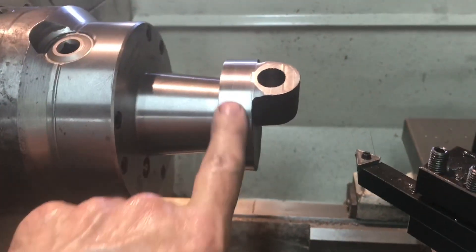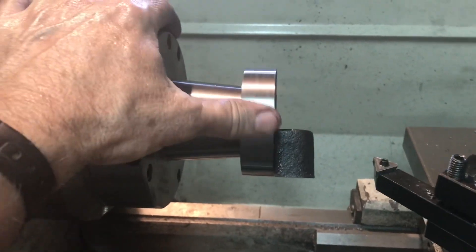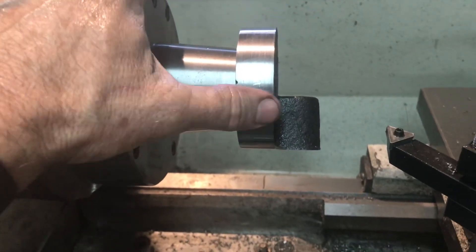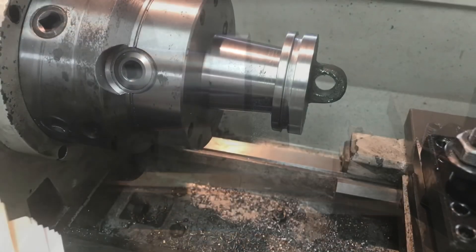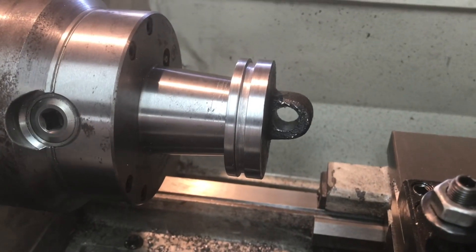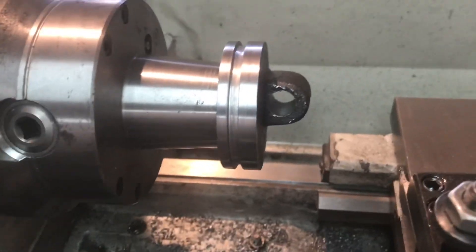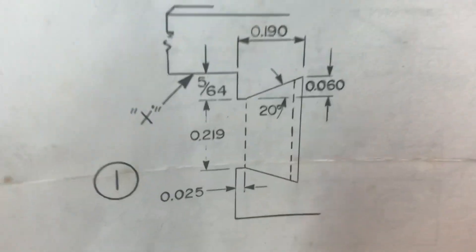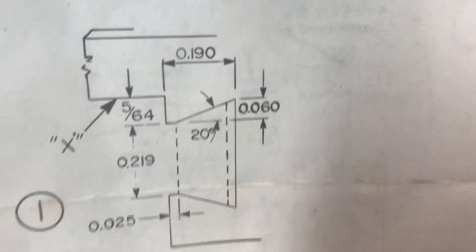I've got this thing down to exactly three inches on the diameter, near as I can measure it. I took a couple extra minutes to file it and run some sandpaper over it to make it smooth since it's going to be engraved with graduation marks. The next steps will be to cut the groove that's going to become the dovetail groove. Here is the rotating base with basically all of the preliminary machining done - I cut the slot 219 thousandths wide and 190 deep so far.